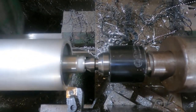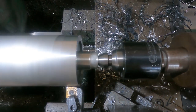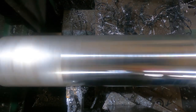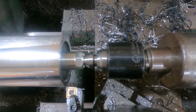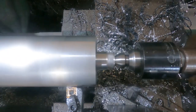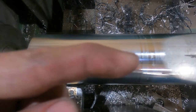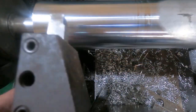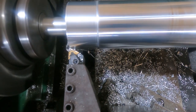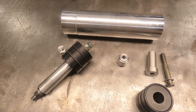Here's our completed assembly in the lathe. Our tapered nut is spinning in the tailstock. We clean up this end, get a nice square corner, then clean up the outside surface. This tubing isn't actually round even though it appears so — there are highs and lows. We take a few passes to clean it up, staying concentric with the center bore and creating outside surfaces that are also concentric. We switch momentarily to a tool that cuts from the other direction to clean up the outer edge, then use a tapered point to cut in a bevel — one of the features of the finished part. We can access the entire length during this turning operation.